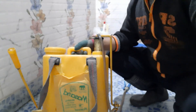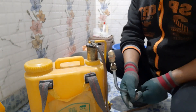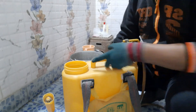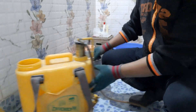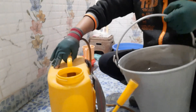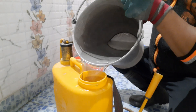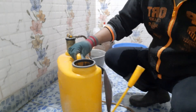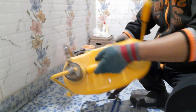We need to do a maintenance of this agro sprayer nozzle. The liquid is not coming smoothly through the nozzle, so we need to start cleaning the tank. We put a bucket of hot water inside the tank. That's the filter — close it and shake the tank well.